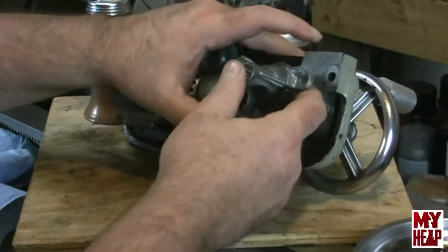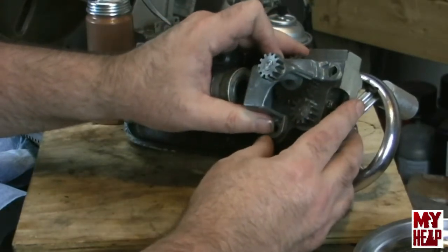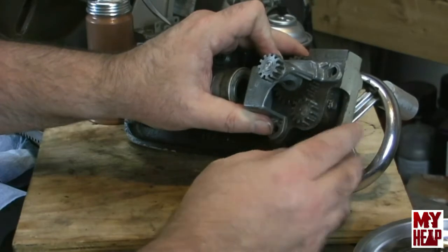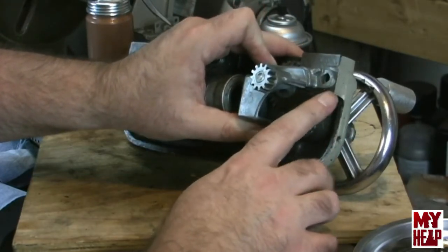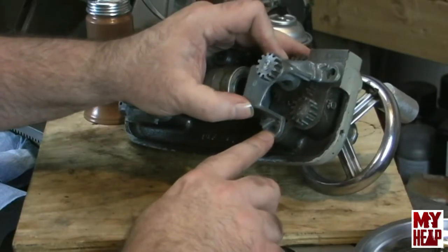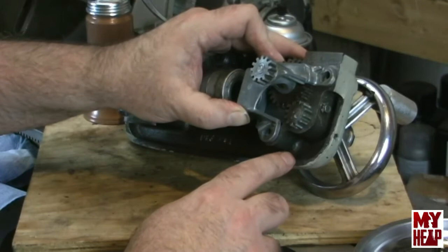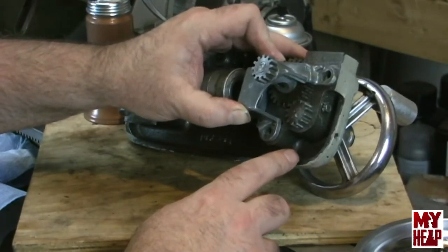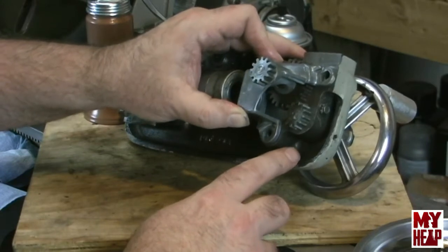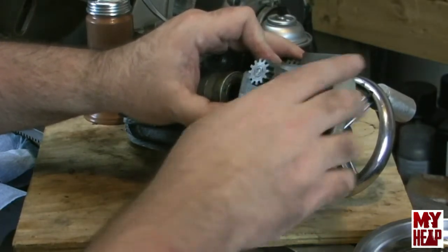But they did. And there's a couple broken taps in there, but that's where they're going to live. And this gets mounted here, and I don't know if the video will pick it up, but see these holes here are elongated, so there's some adjustment here. So what I want to do is get these screws in here with the square nuts on there, carriage nuts I think they're called, just enough to hold it together, and then we're going to set this gap, and then that's how we're going to fasten this in.